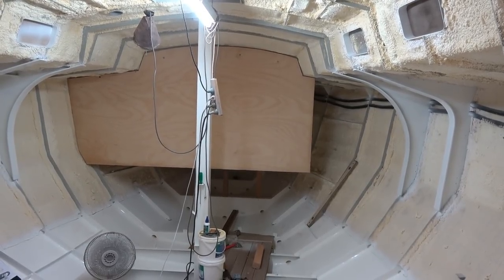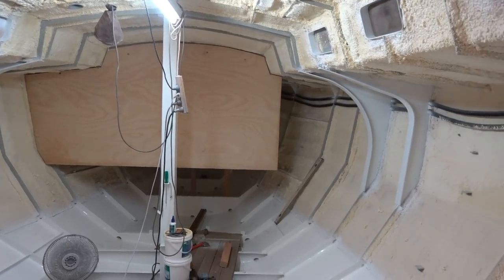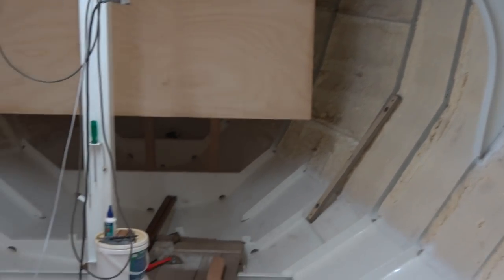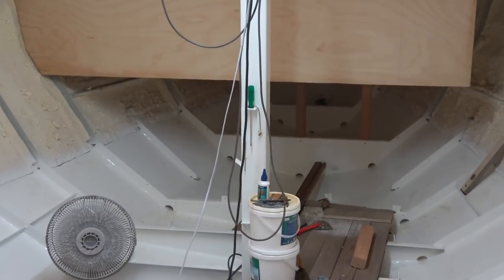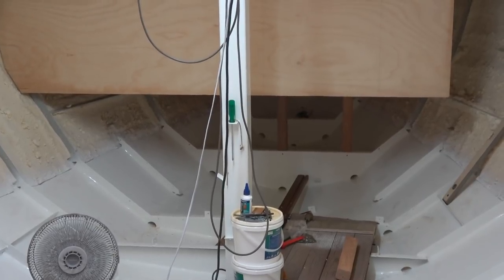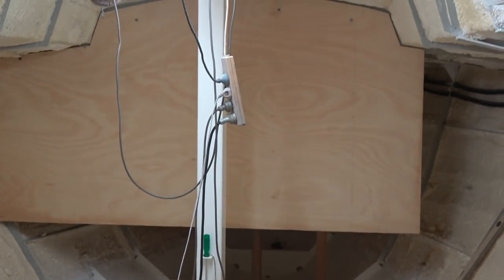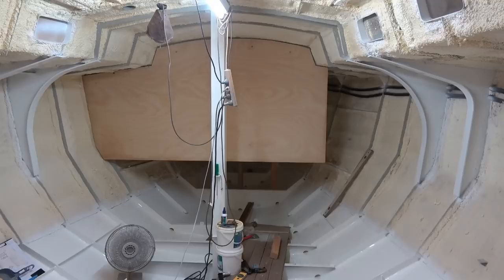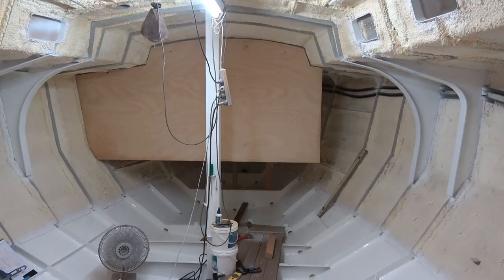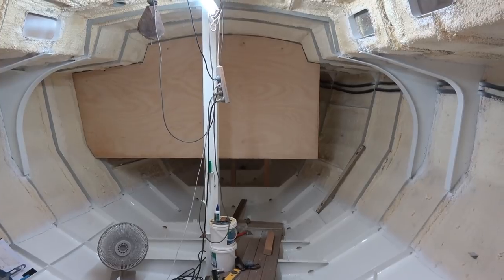It's the full width of 2.4 meters wide. So as you can see, there's a space on the end here, which needs to be filled in, and of course, a piece that needs to go into the bottom. There was no way around that because, as I say, that's a full sheet, 2400 wide. So now I'm going to get busy making those other pieces, and then once I've fitted the other two parts for that main bulkhead, I'll be able to paint everything and finally fit it.